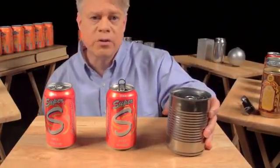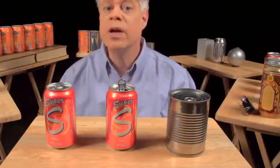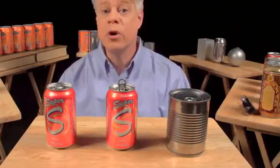While initially pressurized to about 2 atmospheres, a can may experience up to 4 atmospheres of internal pressure in its lifetime due to elevated temperatures, and so the can is designed to withstand up to 6 atmospheres or 90 psi before the dome or the end will buckle.